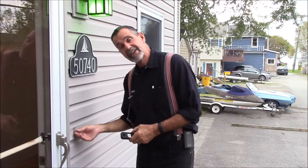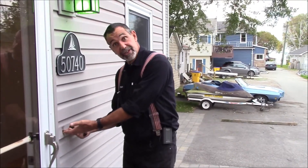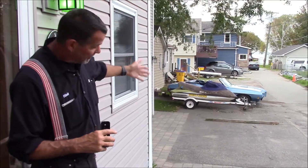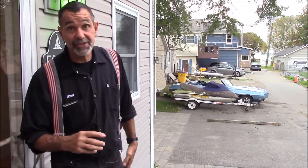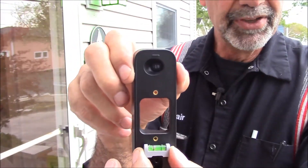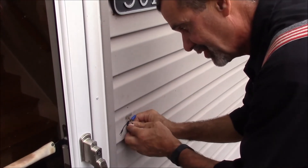Power kit's ready. Now let's go outside and put the chime on. I've got the doorbell removed. My two wires, like many, are too short, so I'm going to have to use the extenders. I want to show my porch and my driveway — I can see down some steps. Even though I'm not quite four feet high, I don't have any reason to make it go lower. They provide a little level so I can level it in. The extenders are on and I've got to tuck the wire nuts into the hole.